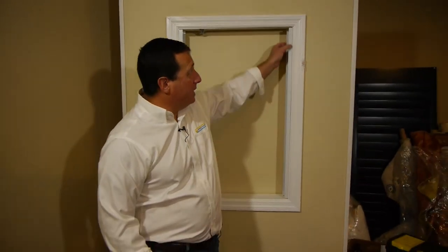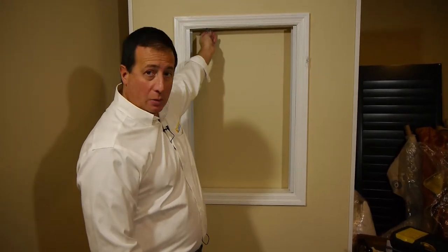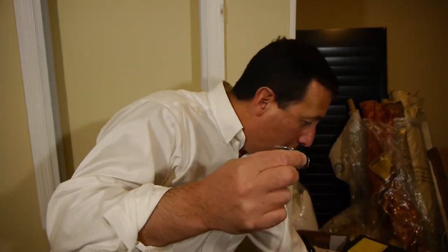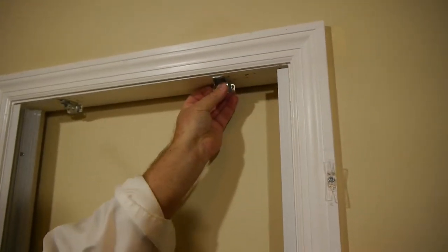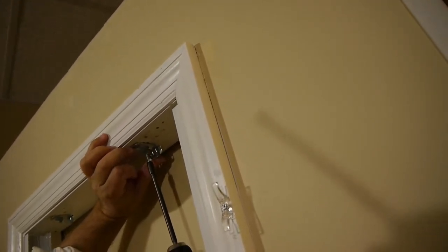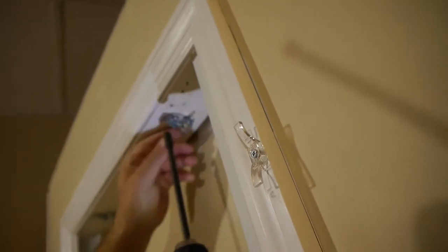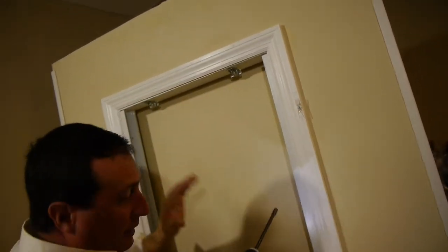Now that your side rails have been installed on both sides of your skylight, we're ready for the top brackets. I've pre-installed one of the two brackets we supply to speed things up. We'd like to get each bracket situated roughly in the middle of the rail, spaced about four inches off the rail on each side. The top portion of the hole is slotted, so put your screw smack in the center in case you need to move the bracket a little forward or backward — sometimes it takes a little tweaking, so leave room for adjustment.